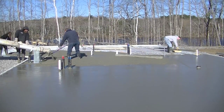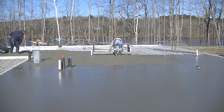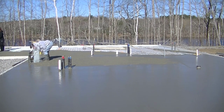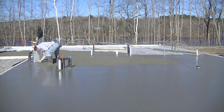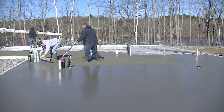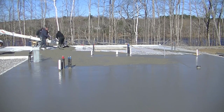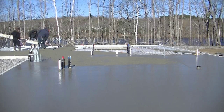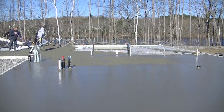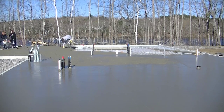I'm making some more wet pads in and around those pipes, making sure we get the floor really flat around the pipes. I'm using about an 8-foot screed now, striking my pads with that. We get as much concrete dumped out as we need to screed it — we like dumping out quite a bit of concrete at one time and then getting it screeded. We like to have plenty of concrete on the ground to work with instead of just doing one bay at a time. But that comes with experience and how comfortable you are working with the concrete.